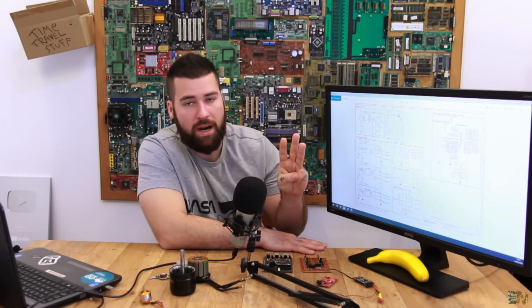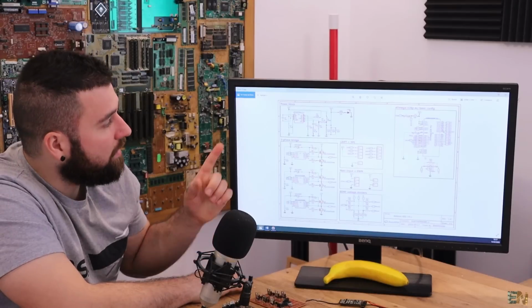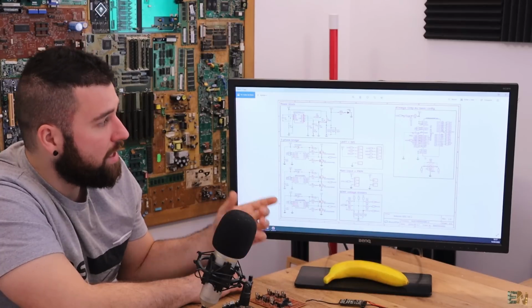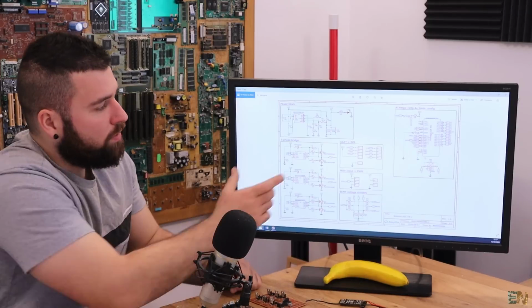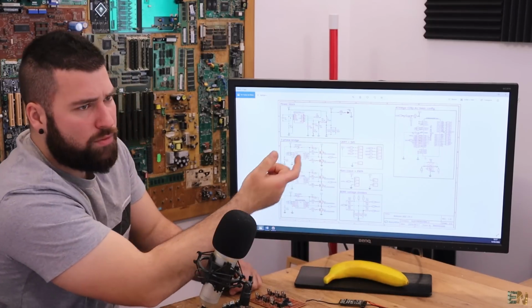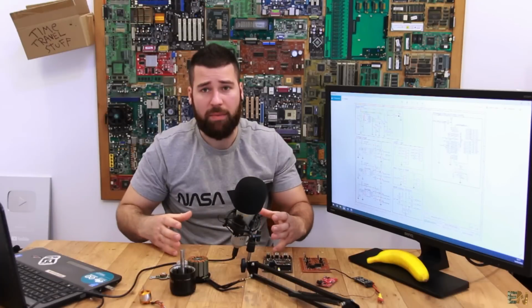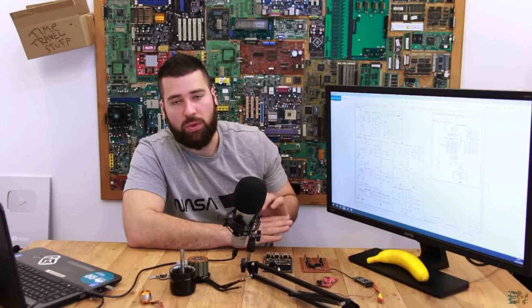So you will need 2 parts of voltage converter. You have to get from 48 volts to 24 volts for the drivers, and from 24 volts to 5 volts for the microcontroller. So you have to have these steps 2 times, and maybe instead of using a buck converter you could use a linear regulator, because when you have a big case you can put a huge heat dissipator on top of the regulator so it won't burn.